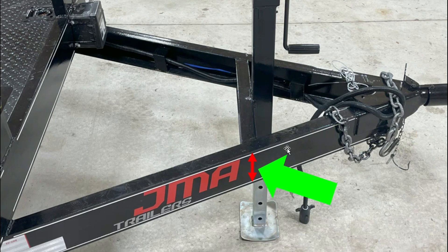The first thing you want to do is take your trailer and measure the height of the C-channel — it's normally five or six inches. Then measure the thickness of the flange at the top, and also the thickness of the C-channel material itself. You want to add steel that's stronger than what's already on the trailer — taller C-channel and thicker material if possible. Also take some length dimensions off the trailer as well.